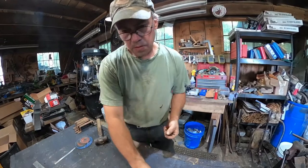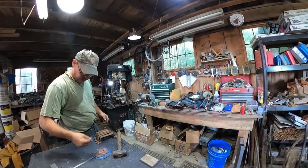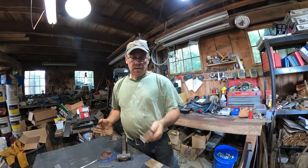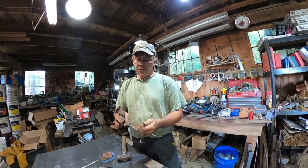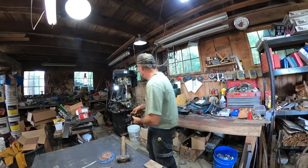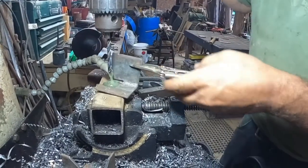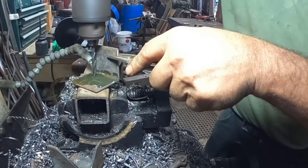I'm going to go grab a screw because we've got to put countersinks on the screws too. These are the screws that we're using. I also made these handles — just eighth inch flat bar, one inch wide, cut ten inches long, one inch to screw two. I put one hole in each one; that there I believe is an inch and a quarter. They will make great handles. I'm going to punch a pilot to start with. Use a little lubricant — it's got lubricant in it as well. The coolant I'm using is called Tri Cool.